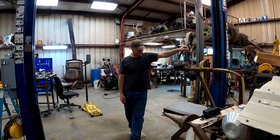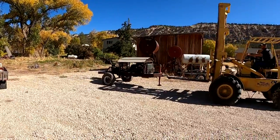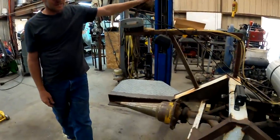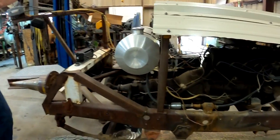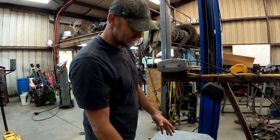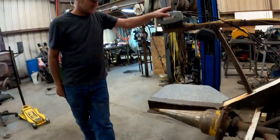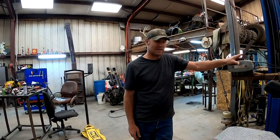Today's adventure is my wood splitter. For everybody that thought my lathe was dangerous, you're gonna love this one. It's got a Chevy straight-six on it out of a Nova, comes into a turbo 350 trans, and then back here to this stickler wood screw. Originally you were supposed to bolt these onto your truck, take your tire off, jack it up, put this on it, and it would split your wood, but I built it into this. They work ten times better than a hydraulic splitter.